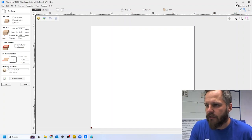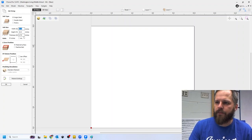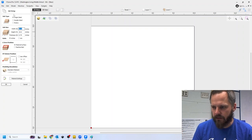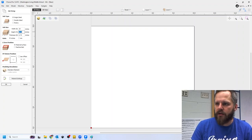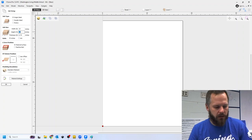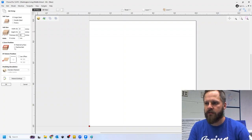If I tell you in class to use a different number, use a different number. For this video, we're doing 10, 10, .75. So job type up here. This job setup is where we have to set up everything nicely first. We are cutting on one side, so we're single-sided. Our job size, this is where you can type in numbers to change the size of whatever you're working with, but we're doing 10, 10, and thickness is 0.75. We're working in inches today, so make sure inches.